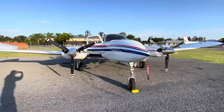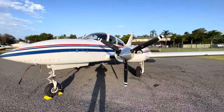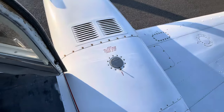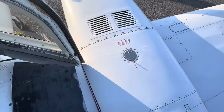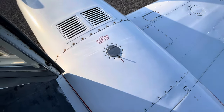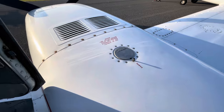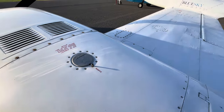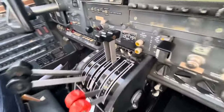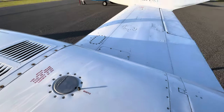I don't really think it's an issue — it's a very lovely aeroplane that just needs a bit more understanding of the fuel system than most twins. To complicate things further, we can have optional nacelle or wing locker tanks; this is the larger size. These tanks don't feed to the engine — they only feed into the mains. You burn enough out of the mains to make room, then turn on the fuel transfer switches, which pump the fuel from the nacelle tank into the main.